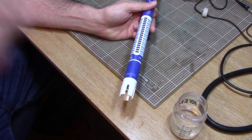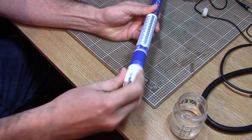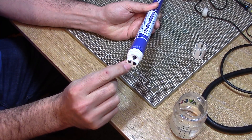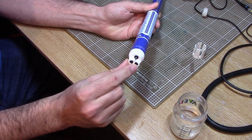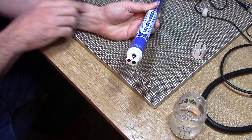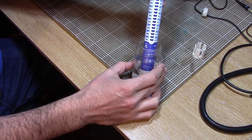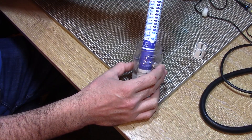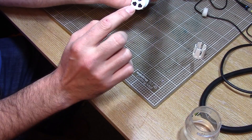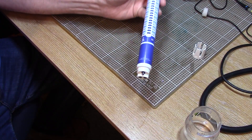That's the simple explanation of how it works, but what's actually going on inside this thing? If we unscrew the little end protector, you can see that what we've got at the end there is two electrical contacts and a temperature sensor. The only way this thing knows that it's in solution can be by measuring across those electrical contacts. There's no on/off switch, so it's going to have to be continually sending something across there to see what kind of result it gets.